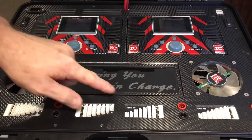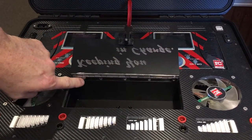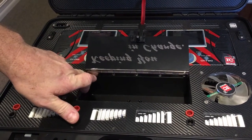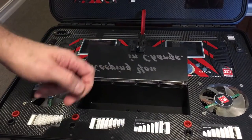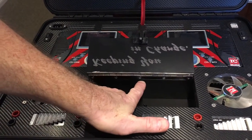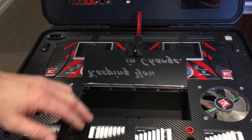On the storage door, you can see the hinge and how it goes in — there are hinge screws that we ship with it. You need to line that hinge up a half inch down, so you'll come into your case a half inch, which is the thickness of the PVC deck. If we're doing a heavy duty deck it's only three-eighths, so you may need to adjust. Line it up with the bottom of the deck and poke little holes — I have a fine screwdriver ground to a point that I use to set the holes in the middle. If you have a vix bit — which is used for hanging doors and hinges — it will line up and leave a dimple dead center of that hole. I'll do one, get one screw in, then line up the other end, get that screw in, then work across.